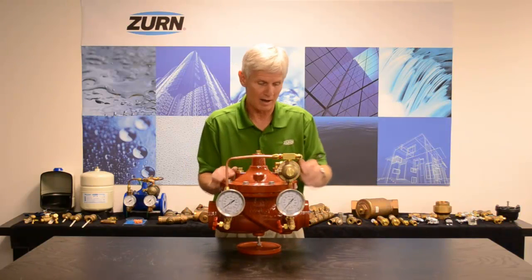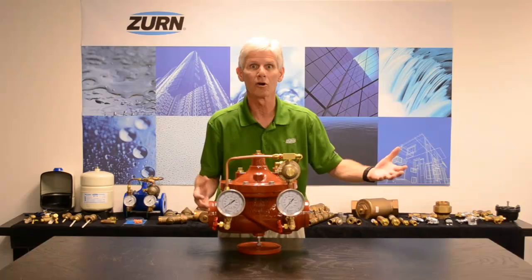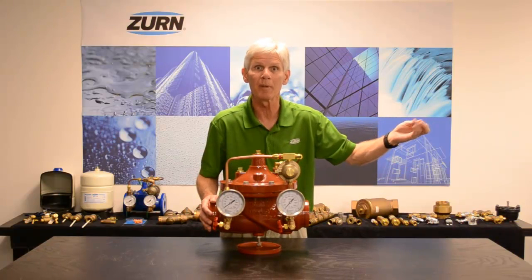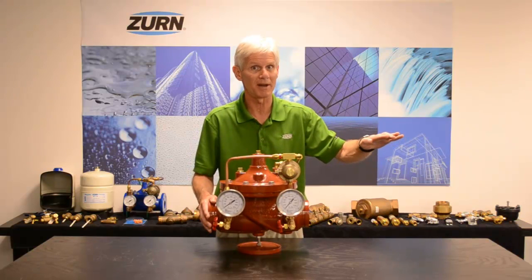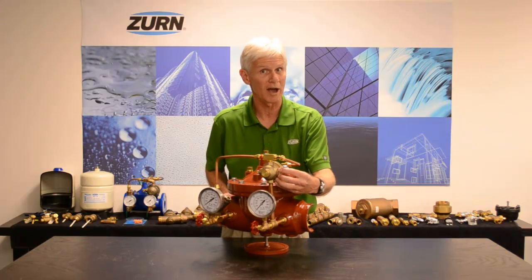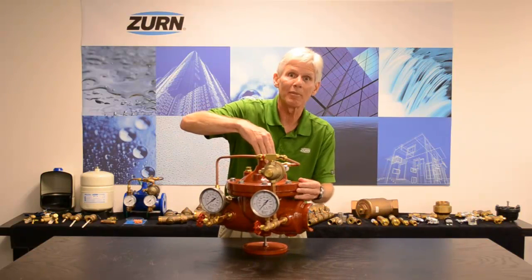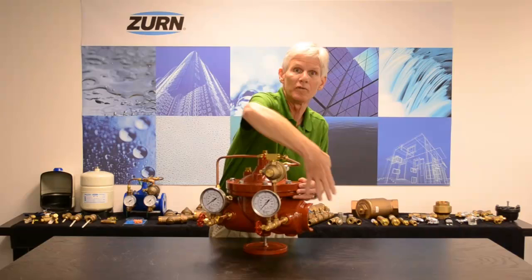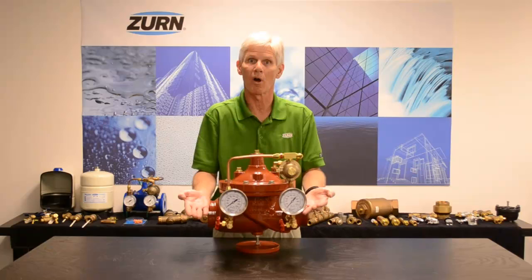To repeat: with my system fully pressurized at 200 psi coming in and yielding 100 psi on the outlet side, a fire occurs and one sprinkler head — maybe even more, but at least just one — opens up. I have a slight drop in my downstream pressure. My direct-acting PRV senses that drop and opens to satisfy demand. It then allows fluid on top of the diaphragm to move to the downstream portion of the piping, and thus my diaphragm-actuated valve begins to open also.